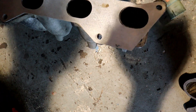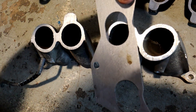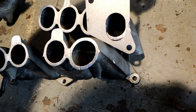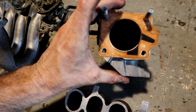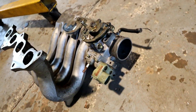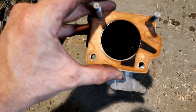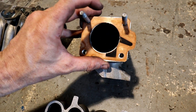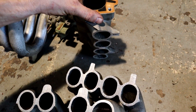It sits on there nice, no restriction. I went ahead and chopped this manifold up so we can see it's a larger circle hole underneath, which makes up for not having the oval shape anymore. It looks pretty sweet. But the problem we're having with Nick's is the hole for the plenum to let the air in. Regardless of what you read online about 4E throttle bodies, the throttle plate is 42 millimeters, and on the 5EFE the throttle plate is 50 millimeters. We don't think the air can get through that hole fast enough — the engine's trying to suck the air in and can't get any more through. We looked online and were just going to buy another Chinese manifold but they're pretty expensive and take a long time to get here.